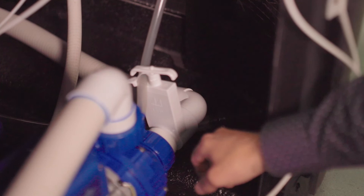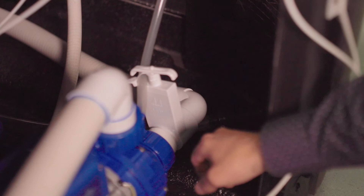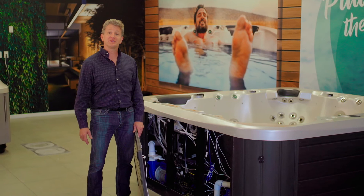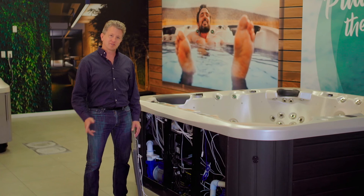We've replaced the lamp and the sheath. Now the really important thing is to open the valves back up to let water into the system. Twist the T-handle that you closed earlier — you can see it coming up — then put the safety bar back in place. Now all that's left is to put the cabinet back on, but first reconnect the lights.